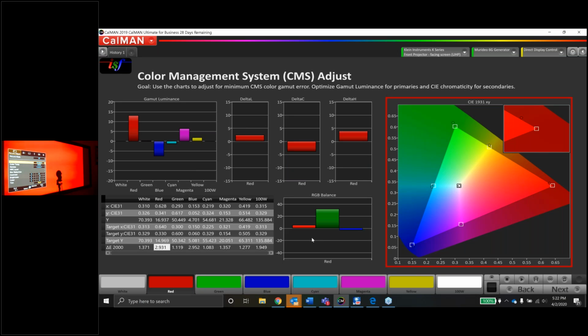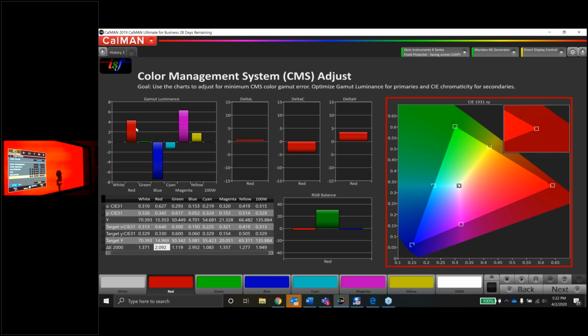and we'll go to that color profile, which whoever gave me that tip before, thank you so much. I would have been looking for that for an hour probably. So the color management is now on. The color selection is red, and we're going to go to the brightness control. The brightness control in this case is going to be the luminance control. Let's take some readings, and red is too bright. So let's lower it, and as we lower it, watch that red bar drop right into place.